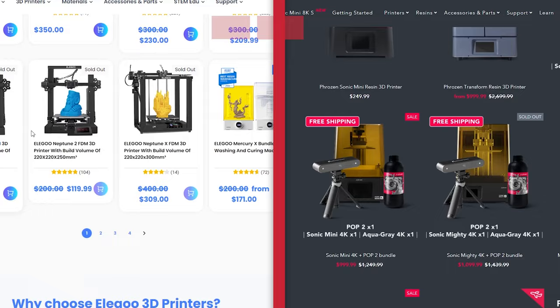Now let's talk about cost. The cost to buy a printer is similar between the two technologies — for less than $200, it is possible to buy a 3D printer. If we consider the raw material, there is also similarity: resins and filaments cost on average around $30. Comparing a 75mm miniature called Balgin, it uses about 54 grams of resin versus just over 48 grams of filament — very similar. But printing on resin takes less than 7 hours compared to almost 14 hours on the filament printer. To match print time, you'd have to increase layer thickness on the FDM printer, resulting in much coarser detail.